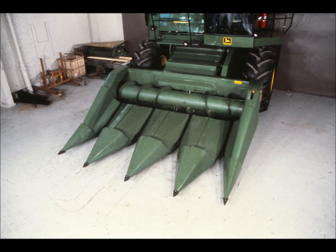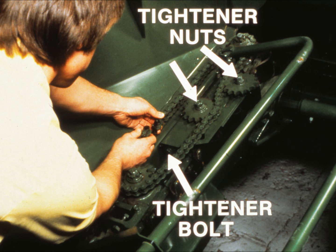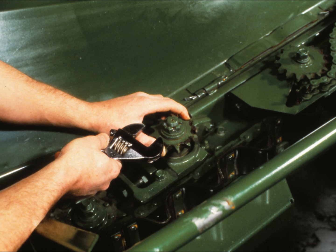Several field adjustments can be made depending on the crop and harvesting conditions. In this program, we'll cover just four major ones, beginning with the tension of the rotary knives. To adjust, first loosen the two chain tightener nuts and loosen the chain with the tightener bolt. Then remove the chain by breaking it at a connector link. Next, remove the cotter pin and loosen the slotted nut until the knife can be moved by hand. Adjustment is correct if the rotary knife drags just slightly against its stationary knife. When correct, replace the cotter pin and remount the chain. A properly adjusted knife will be warm, but never hot, after operation.